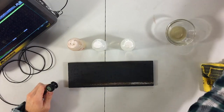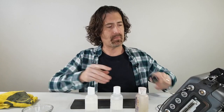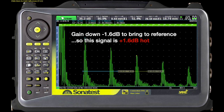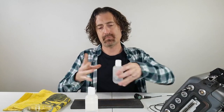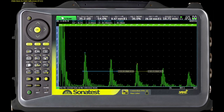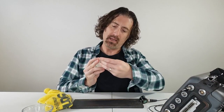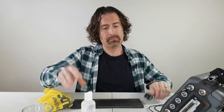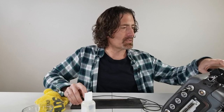After cleaning off the probe, we move to the first couplant — it's about 1.6 dB better than the baseline. Couplant number two is slightly more viscous and reads about the same. Couplant number three is the high acoustic impedance ultrasonic couplant for rough, pitted, corroded surfaces and concrete — about the same, maybe a little better. We'll call it 2.2 dB — slightly better.